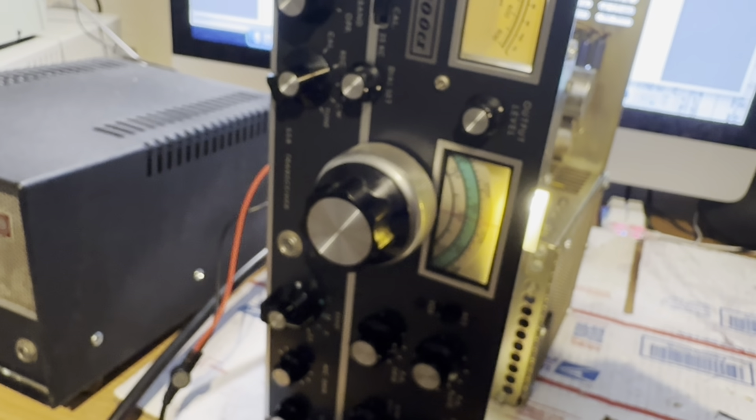Found the tuning tool — it's still in there. So we're in the balance modulator here; you can find it on the bottom. Tune that for max watts. And there you go — hit the bottom again. All right, that's perfect.